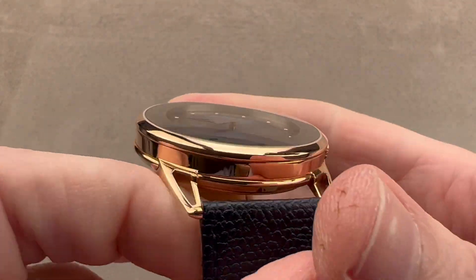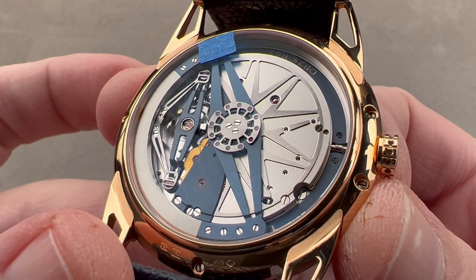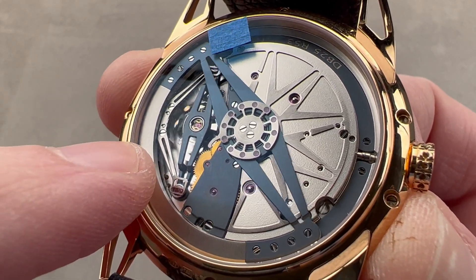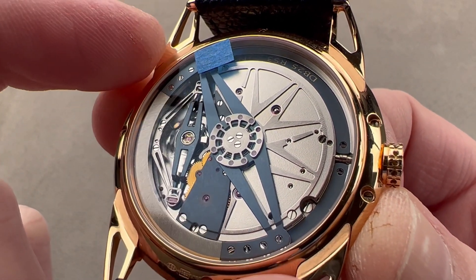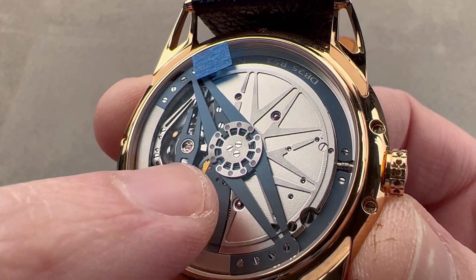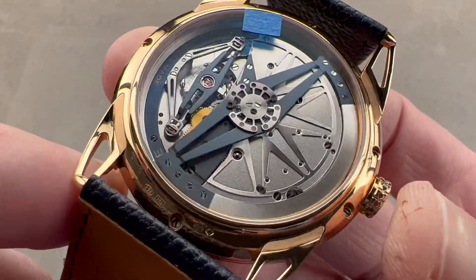I should mention De Bethune makes its own cases, its own dials, its own movements, and you can actually see the De Bethune maker's mark on the case. So when you spend your money on a De Bethune, the money's going back into the manufacturer. Now, this is a movement that first launched in 2006, the DB2024 — it is Denis' take on an automatic wind system. There's a precious metal mass outboard of a very broad set of rotor arms. By creating those long arms, you maximize the winding mechanical advantage, but you also create the risk that it might flex torsionally instead of just turning rotationally. So to brace the rotor bearing at center, Denis patented a spring-loaded system for bracing the rotor against unintentional displacement — that's why we have four cantilever springs. And to reduce friction when the rotor touches the springs, you can see each one contains three ruby jewels. You better believe that's patented.